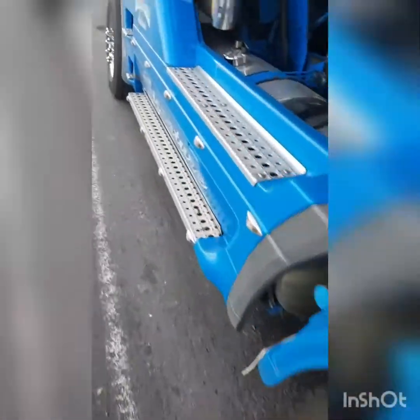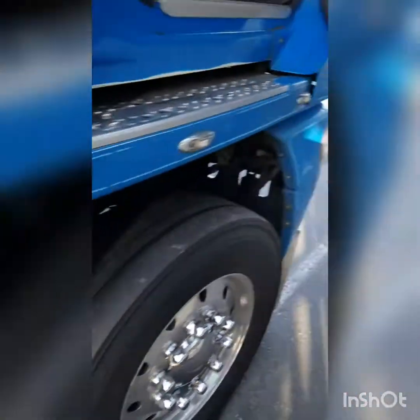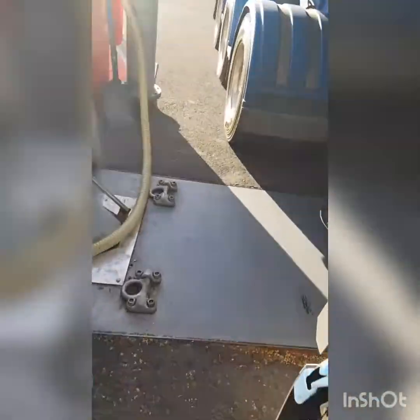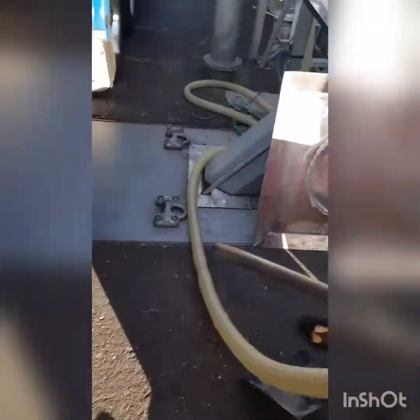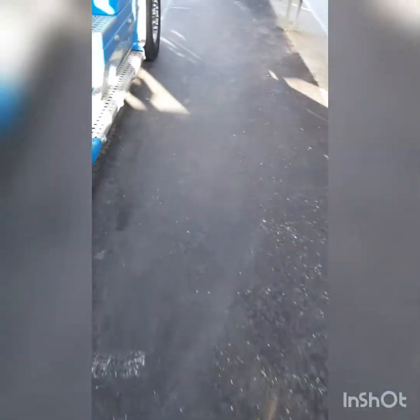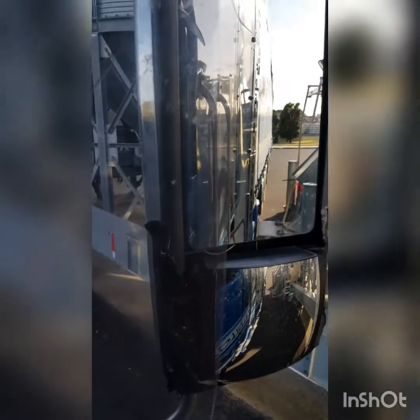I know some people say, oh, you should have pulled the trailer brake before you pulled the back Susie off. And you're right. But there's no danger here of me pulling that line the way I did and evacuating the back unit, because we're dead flat. The unit's not going to roll on you, and the amount of pressure that's actually on this 5th wheel plate will prevent that unit from going anywhere. Off the top of my head, I think there's about 13 tonne sitting on there, maybe 12 tonne. So, not a major. Alright, so we're back in here now.